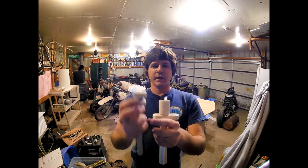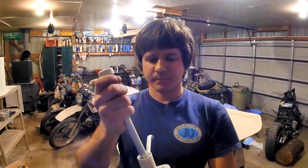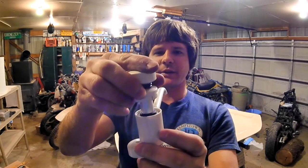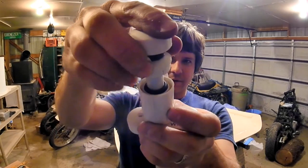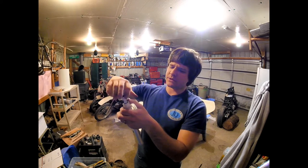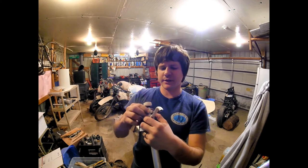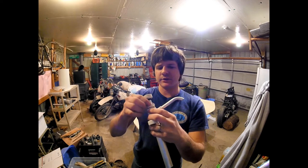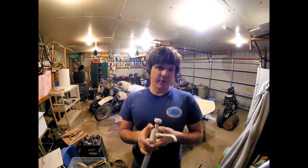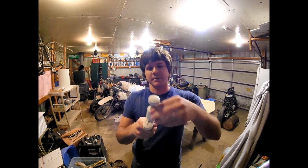The top collar helps press the extra O-ring down on top of the original gasket. That's going to go right down on there and sit right on top of the original gasket. This top cap has a little cutout — if you look on the nozzle side, there's a small cutout where it actually fits into. Just line that up and press down. With that extra O-ring it might be a little tighter, but it does fit. You might hear it make a little snap — that just means it's locking into place.